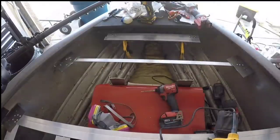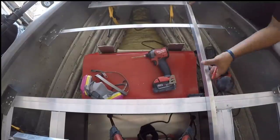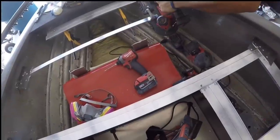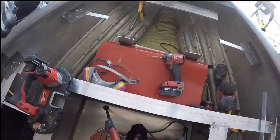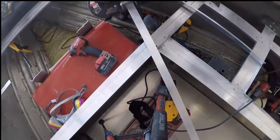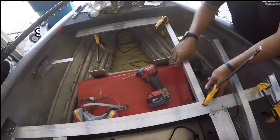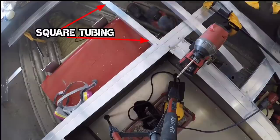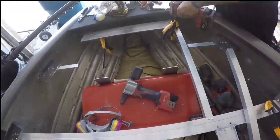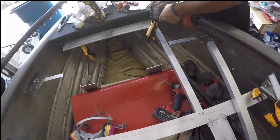T-framing aluminum together, riveting it, giving a fairly copious amount of rivets per each actual attachment spread — three to like five. The more you have, the better the joint. Normally I would run a piece of angle from that section all the way to the front, but because we have no way to put under supports, we're going to have to run tubing. Tubing is the only thing structurally sound enough to run from that part to that point and still be free enough to hold the deck up without being hindered by tubes flooding underneath.